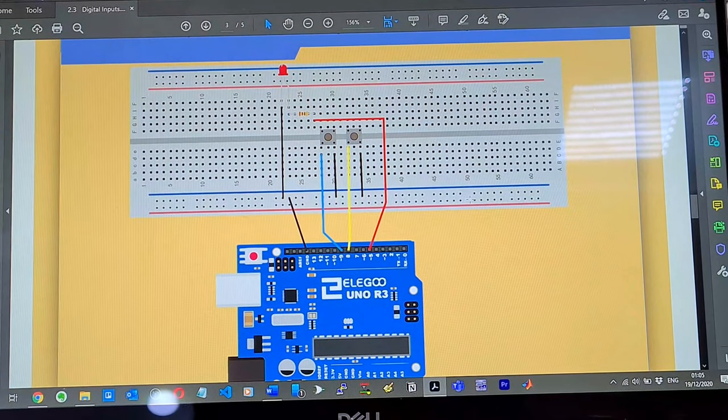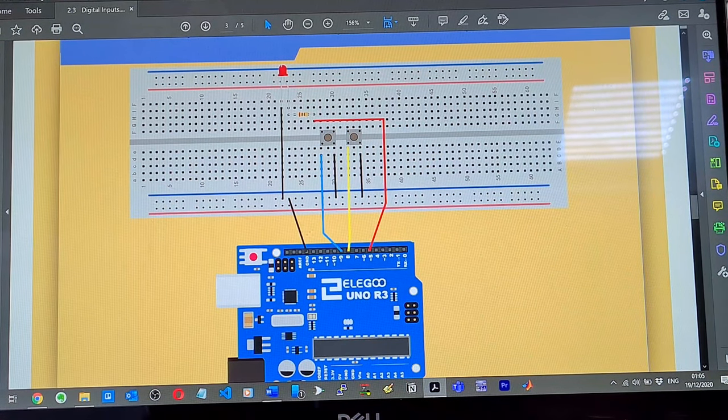Alright, so let me try to understand this schematic, or this board overview. We're grounding the LED here. We've just got a standard resistor and LED. Before that, we have two switches, two push buttons. So 6, and then to ground. And then, oh sorry, 9. Output 9, then to ground. And then 8 to ground. And then you've got 5 PWM into the resistor.